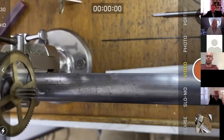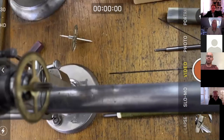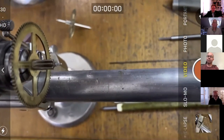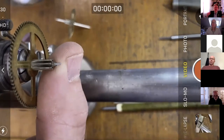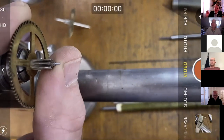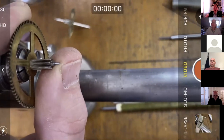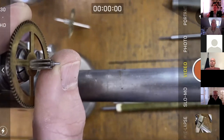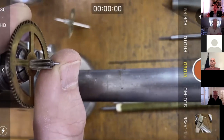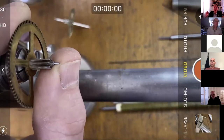So he thought that a drill produced an oversized hole, before the drill comes out the hole easily. How come the 1 mil pivot was a tight fit in a 1 mil hole? Great question from Dave L. How come the pivot, or whatever size it is you drill with, is a tight fit in the hole? It's because I make the metal a bit smaller before I start making the drill. In this case, I stoned off 0.03 millimeter. You're absolutely right. A drill will not make the size of a hole that it says on the shank.